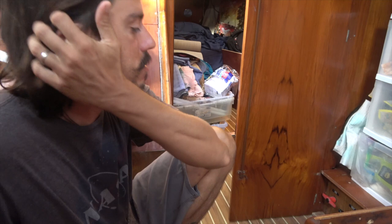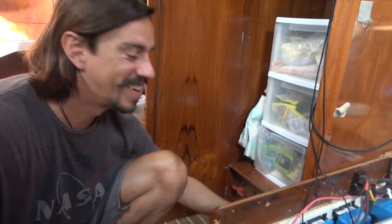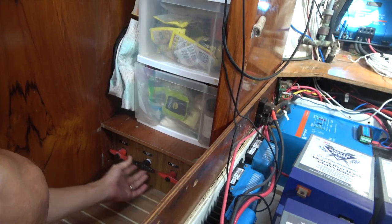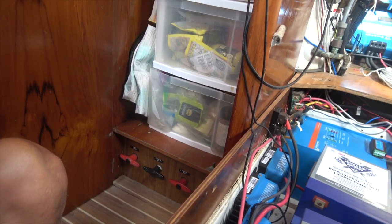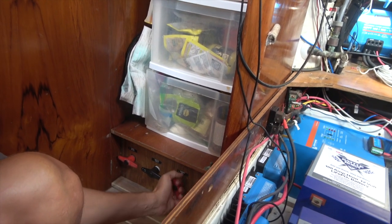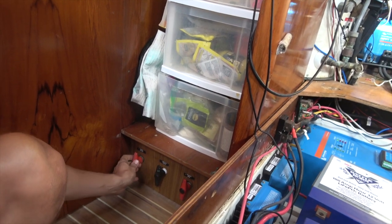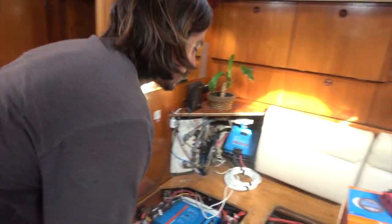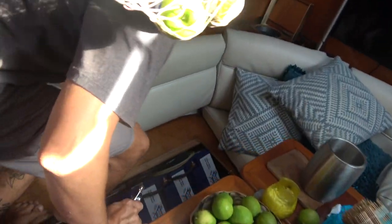Okay, you ready? Ready, sir. Once we do this, we're committed. There's no turning back. You sure? Sure. All right, so this is our battery switches, the main overload, the main contacts entirely for the boat. So, all right, switch them 90 degrees. Boom, ship's down. Okay. Everything disconnected. So now we can do this wiring and start disconnecting batteries.